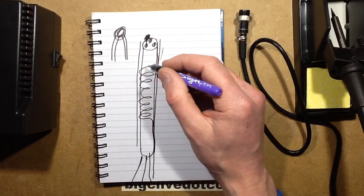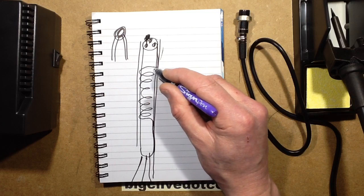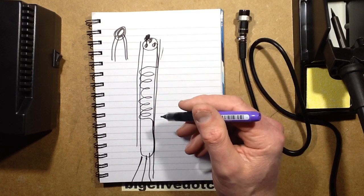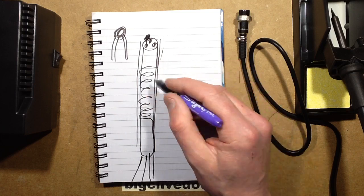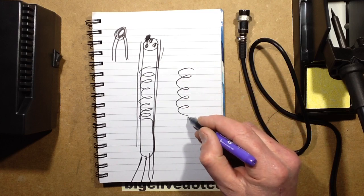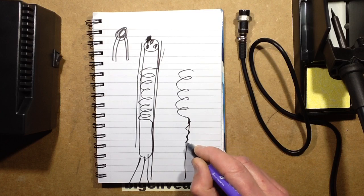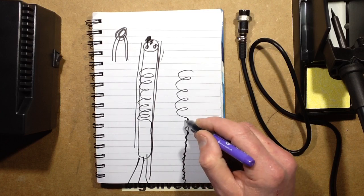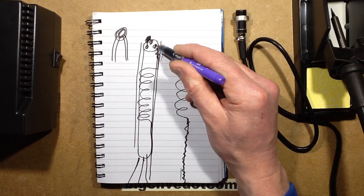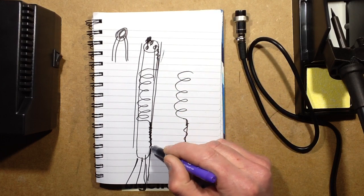It's very clever. It's also worth mentioning that you can't really solder or easily connect onto these heat element wires. It's just an alloy that doesn't lend itself well to soldering. So what they actually do is, at the end they take the same wire that's used as the heat element and twist it with another wire, and that makes the connection. They twist it for quite a run. In the case of this one, the twisting starts pretty much here and goes right down the middle with the twisted wire.